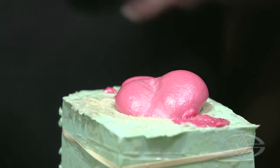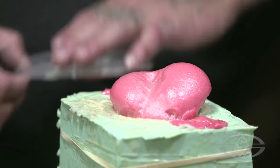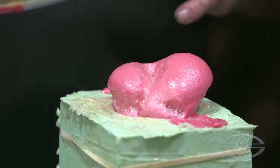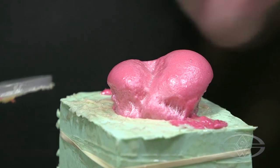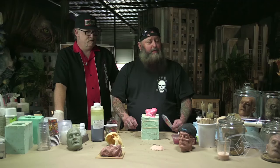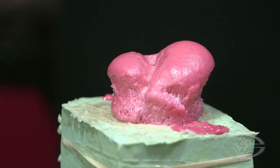If we had this lid on it earlier, you don't want to mess with it now with that hole. You could try to pressurize it, and it'll make a denser foam. That's why a lot of closed molds. This is a fairly closed mold. I mean, the pour hole's smaller than the whole thing. So you can see how that expanded and we got a little nuclear explosion.